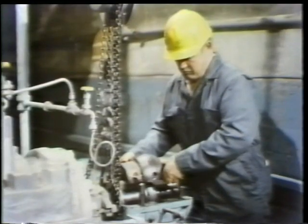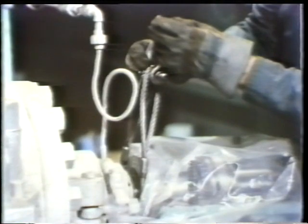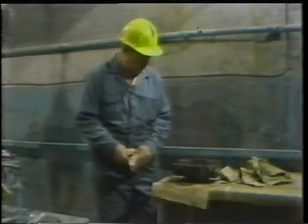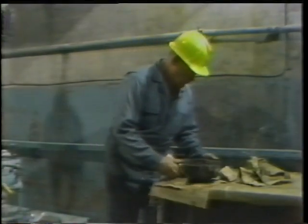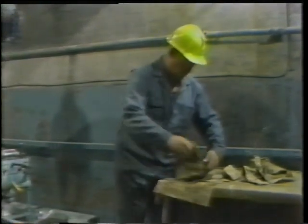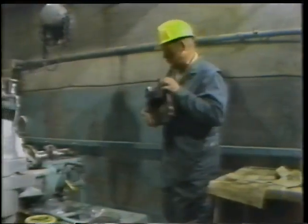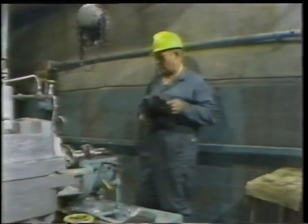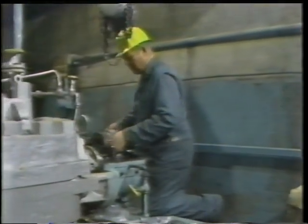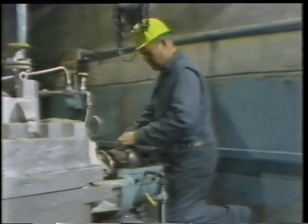Next, the lower bearing shell is rotated back into position. Then the bearing is covered so the chain, hoist, and sling can be safely removed. Next, he's ready to install the top bearing shell. Of course, before doing this, he checks the match marks to make sure he's mating the shell halves properly. Then he sets the top shell in position. But he uses care while doing this. If the shell is dropped, serious damage could result.